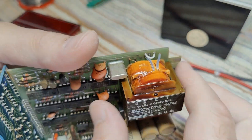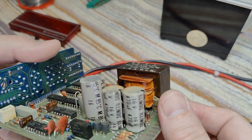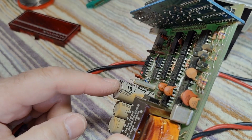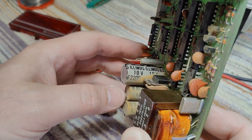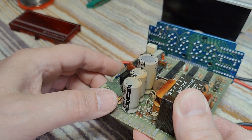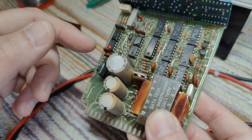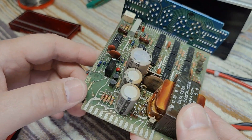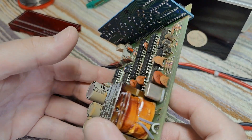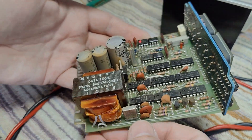I think it's a dual-slope ADC and it's time-based — that is why you have a crystal here, and this is why it is so accurate. It's probably one of these capacitors like that one. There's a little trimmer here for accuracy, and we have two different holes — one is probably for zero and the other for gain. There's a capacitor that's lifted — that's an interesting kind of mod. Maybe it's just running on pulsating AC and there isn't any high-voltage capacitor. That probably explains the blinking as well — they're trying to make it as simple and compact as possible.